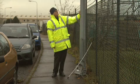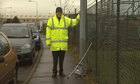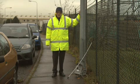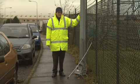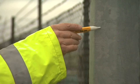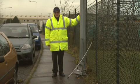First of all, obviously, check the column's not falling over or causing you any other danger. Secondly, check there's no traffic danger to you while you're carrying out the work. And finally, make sure the exposed conductive part of the column is not energized from an internal electrical fault — it's not unknown. Use something like a volt stick. This one's safe, so we can go ahead and take off the door and start work.